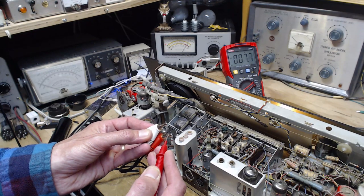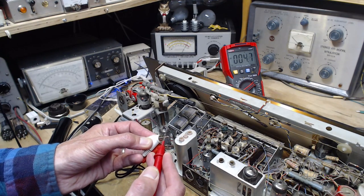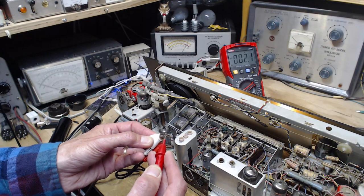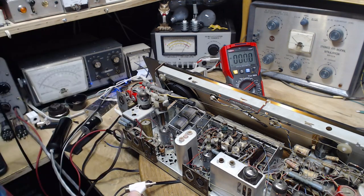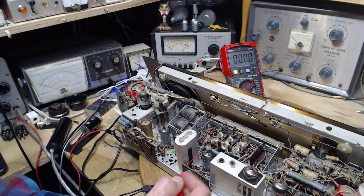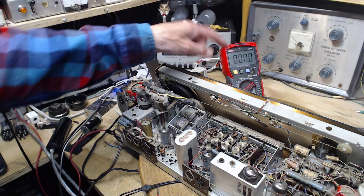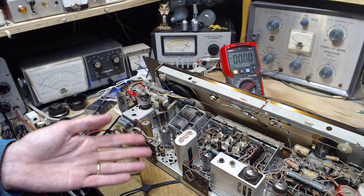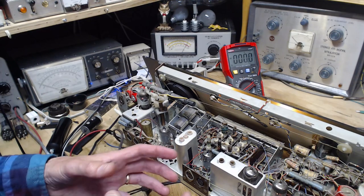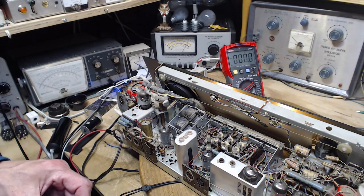You see, there's a DC voltage building up here, which I'm shorting out, and you can hear it. That's the other channel. It sounds a little different. Voltage building up here. Okay, so normally all this stuff is protected by capacitors, so you don't get the DC voltages in and out of these connectors. It does not seem to be working that well. Now, if I took something of a lower impedance, something other than this high impedance meter, and attached it, such as the 50,000 ohm input or output to the Bluetooth receiver, it's probably 50,000 ohms or somewhere around there, that might be enough to just bleed away this charge, result in a small DC voltage sitting there, which is maybe of no consequence at all.